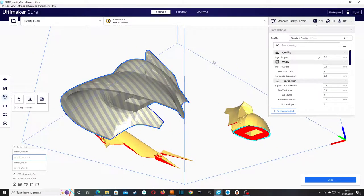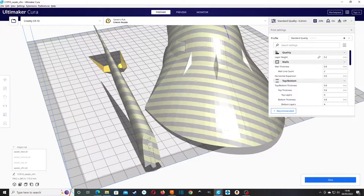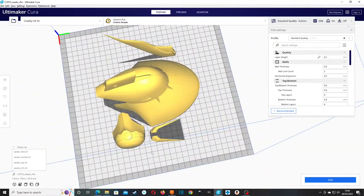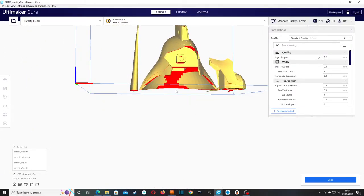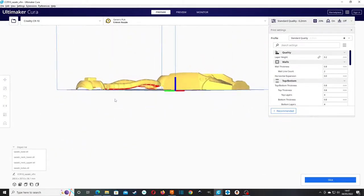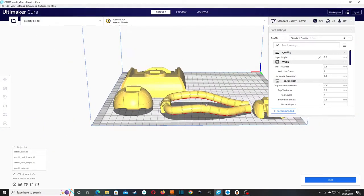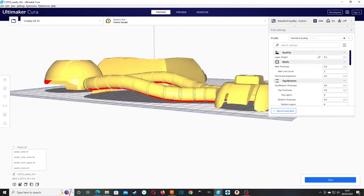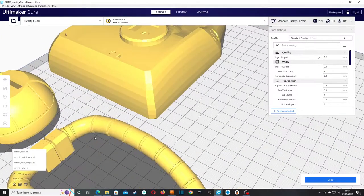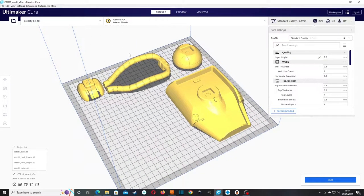I flipped this one back and I flipped this one over to this side. So, arrange your models — that's roughly what mine's going to look like. There is going to be a lot of support material under there, but I was finding there was even more when I did it the other way. I was trying to do something fancy with the pipes, but nothing was really working. These are actually kind of a really awkward orientation for FDM printing — you really want a flat surface. To be honest, I suspect this one was designed mainly for resin printing, at which point that's perfectly acceptable.